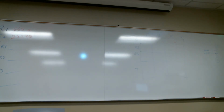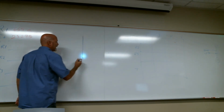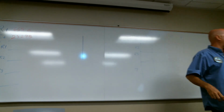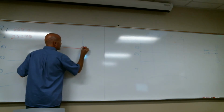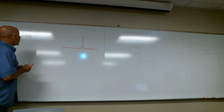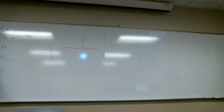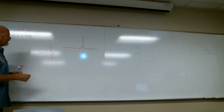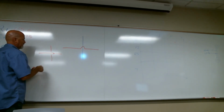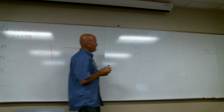If I draw a line, suppose this is a wire, and I have another wire. I'm going to do it in red just for clarification. You're going to know it's a different wire because it's red. But if they're the same color, what I do is I draw it this way. Where you will see things that look peculiar, that's like a little bridge. They don't touch. If these were intended to touch, there would be a node, a little dot, and it wouldn't have the bump in it. It'd be straight. So it would look more like this. That would be a direct indication that those shared.